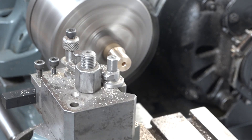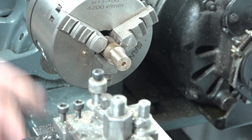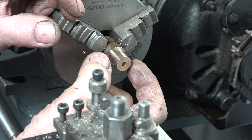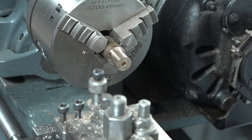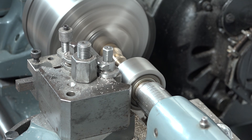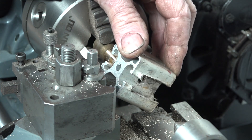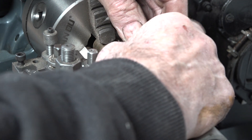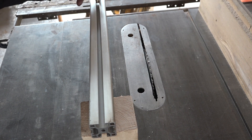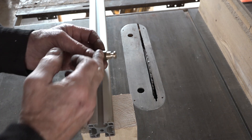A cleaning cut and that'll do. If I machine a tool that will just carve out the perfect slot in there, I can go down to the required width so it just sits nicely within the two bits of track. I think that will be it — it goes on but it's a little bit tight, so I'll just relieve it slightly on that side. That'll do the job — keeps it locked in place. I'm just going to go and part that off now.